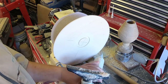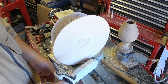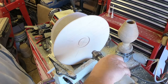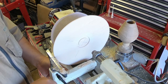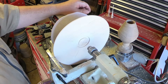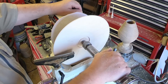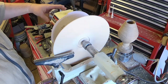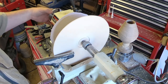As always, I want to use the tailstock as much as possible, so I'm going to bring that tailstock in. I can't turn the whole thing in one big pass anyways because it'll be way too flimsy and angry with me if I try to turn it all in one chunk — it won't be happy. Tailstock is now in place, it's tight, and I have the support I want. I put the tool rest where I want, nothing hits as I spin it around, so time to true up some of this front.